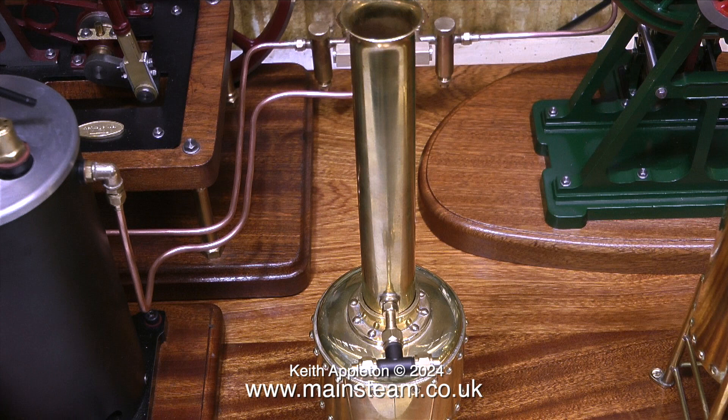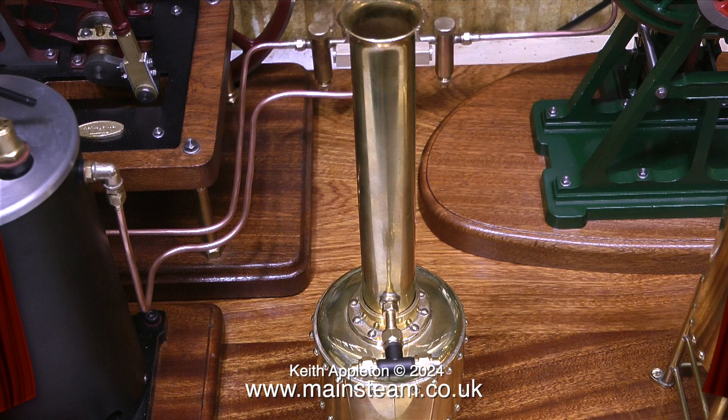The original source material for this video was made in 2018. This device is called a chuff pot, and it's designed specifically to amplify the sound of the exhaust of a steam engine. The design would be great for very small steam engines such as Mamod or Wilesco — it would make them sound like a much bigger engine. Because the steam plant has two engines, I need to fit a T-piece into the piping circuit.